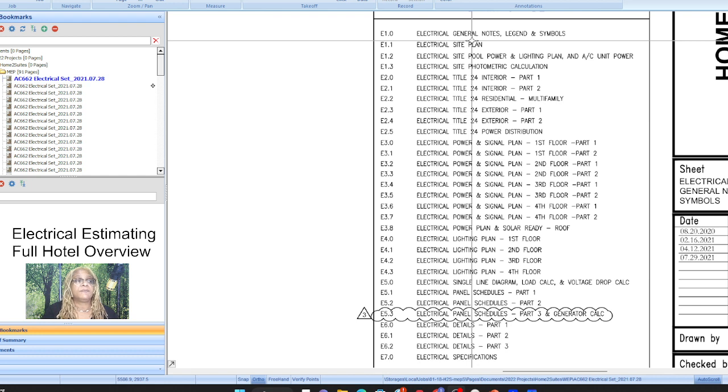The most challenging part, and we'll see when we get to the single line diagram, is to physically look at the plans and try to figure out, okay, where's the panel for the pool? Where's the main distribution panel that it draws off of? And just make sure you physically take that measurement, because power feeders are very expensive, and so you never want to be short.